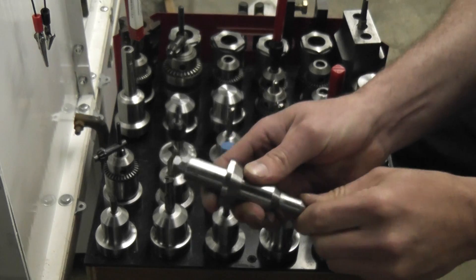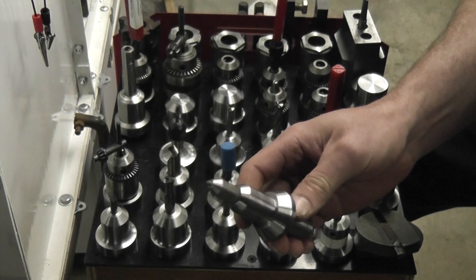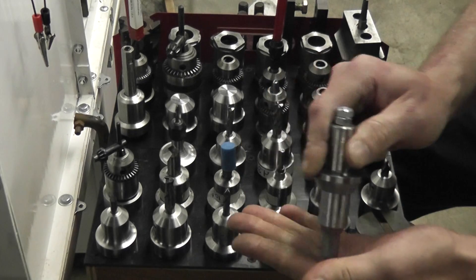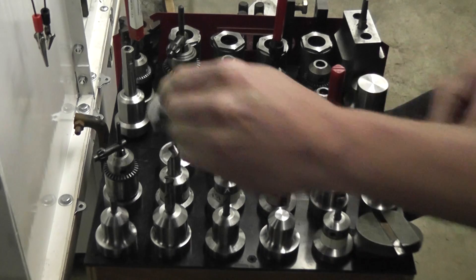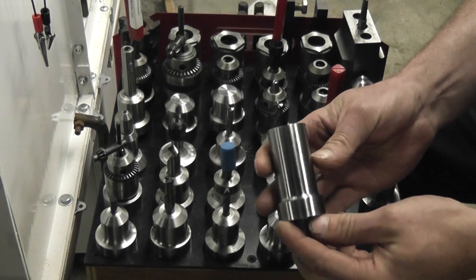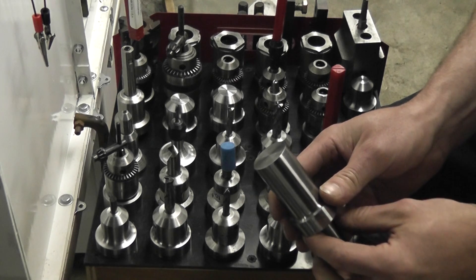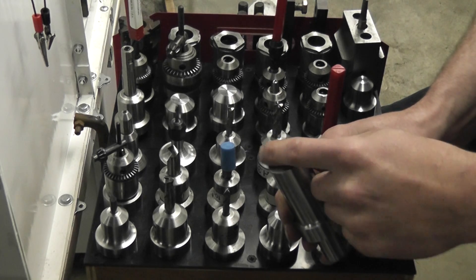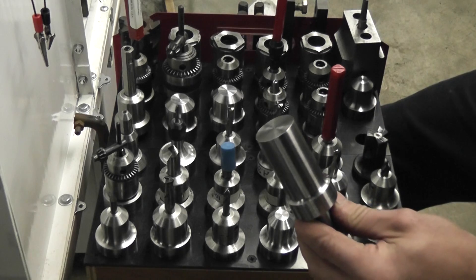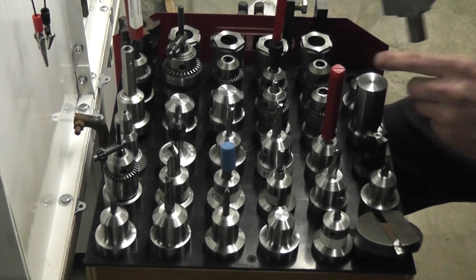There's a drag engraver — this is about two years old, it's just spring-loaded, not keyed or anything. There are vibrating Dremel engraver bits in the end, made out of carbide, and it just drags across your part. This other one I'm not sure what it's going to be yet — probably a boring bar or form tool holder. I need to either mill a slot in the top or make a square hole in the side to put some regular lathe plate tool bits in it.